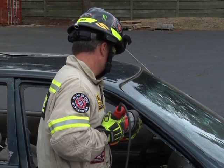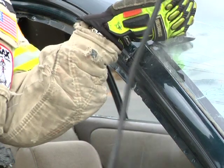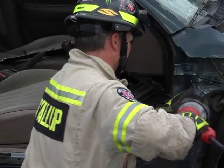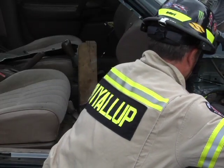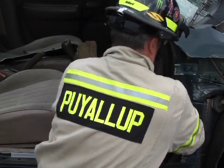Next, make a vertical cut or take out a 3-inch section of the top 1/3 of the A-post, followed by making 2 horizontal cuts large enough to insert the first responder jack. Now remove or bend out of the way the section between the 2 cuts.